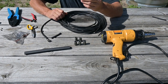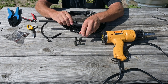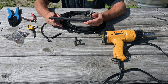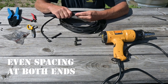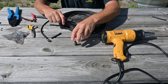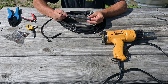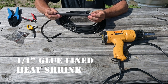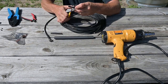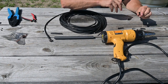The first thing we're going to do is assemble our beads and place them into our heat shrink tubing — this makes it a lot easier. Load your beads in here and push them all close to one end, leaving the same amount of space on the other end for when we apply heat to seal it up. Since it's pretty thick it won't fully seal, so we're going to add a couple of small pieces of coax at the very ends of this assembly.